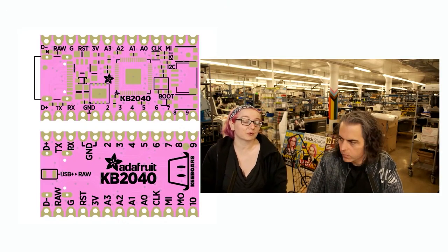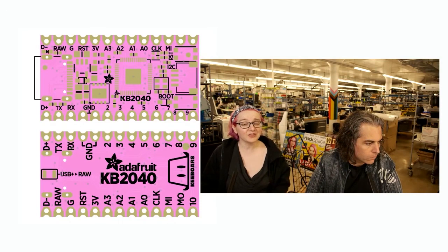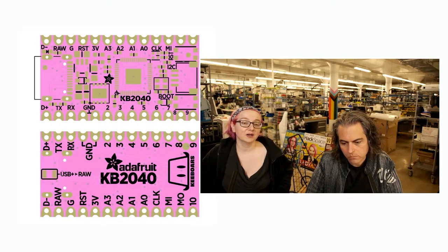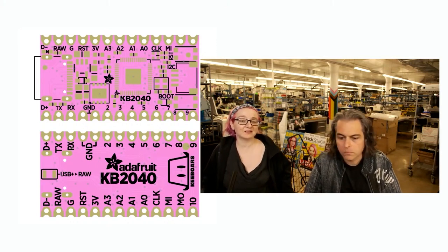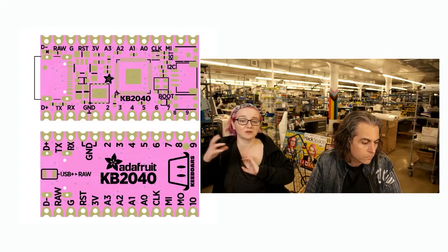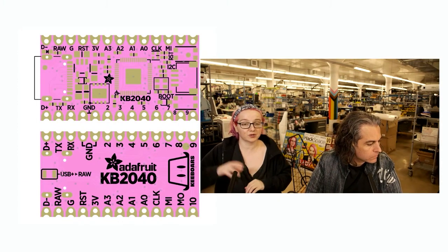However, CircuitPython keyboard support is really good, and there's KMK — the CircuitPython port of QMK — if you want to use an existing structured system. With the concurrency work they're working on, it'll be better and better for keyboard projects with the RP2040. Given we're doing all this keyboard stuff, I thought let's throw in a keyboard design. One thing I did that's kind of neat is I added a jumper on the bottom for USB power to five volts — that's kind of from the Elite-C — and I liked bringing up the D-plus and D-minus pads, because sometimes the USB port isn't in the right place and you want to get that data elsewhere. It has a USB Type-C port, but if you don't want to use that port, you can always wire up a port elsewhere.